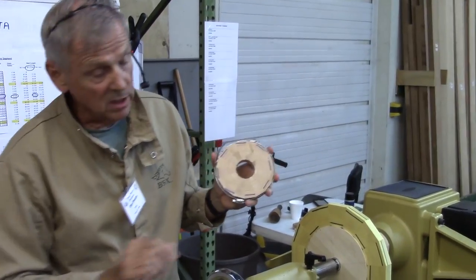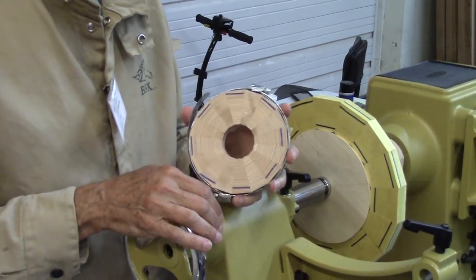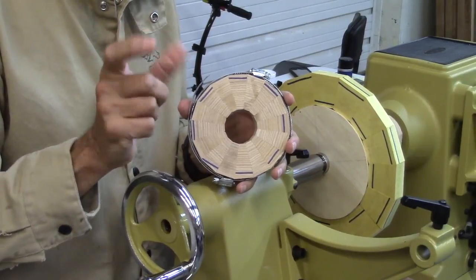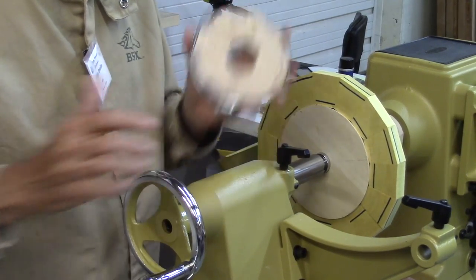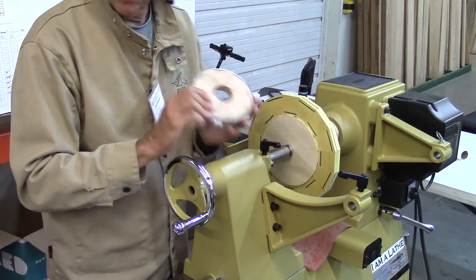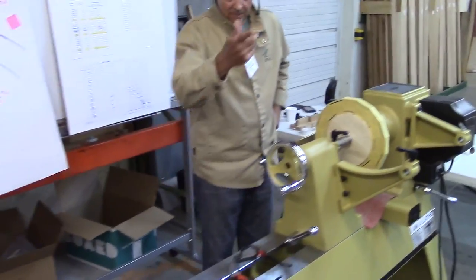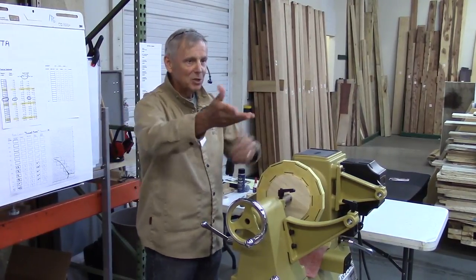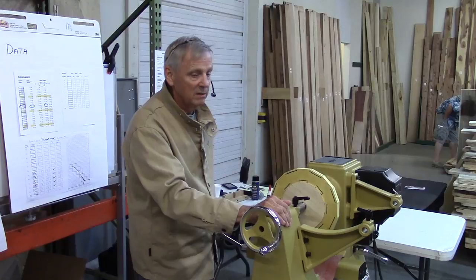Use a more generous amount of glue than you would for furniture, and always check that you can't see light through the ring joints. This sample was cut straight from the saw, no adjustments, and there's not a light gap anywhere. For bigger bowls I went to Home Depot and the guy suggested I just put two hose clamps together for a 14-inch bowl — which was obvious but I hadn't thought of it. You can buy 8-inch ones and connect them around; no need to find a 24-inch hose clamp. You can also find larger band-style clamps in the heating department.